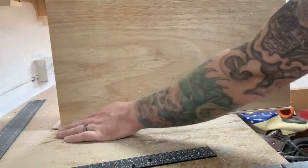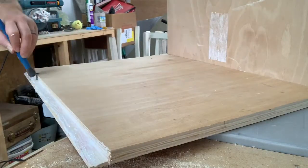So what I've accidentally gone and done is cut out two centre pieces instead of two end pieces. The centre piece is actually a little bit shorter than the top, the bottom, and the two sides, so I wasn't sure what I was going to do. But the back panels are supposed to go to the back on the top and the bottom anyway, so I decided instead of splitting them down the centre piece, I could just cut them to run the entire width of the bench. Because I don't have any plywood big enough for a single sheet, we will have exposed plywood edges at the back — but I'm going to put some trim around the sides which will hide that anyway. I glued and pinned the panels into position with the help of some trusty dumbbell clamps.